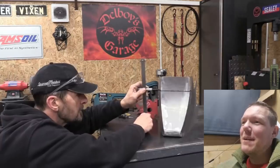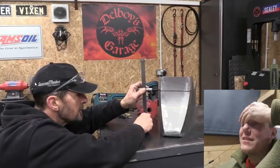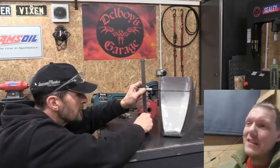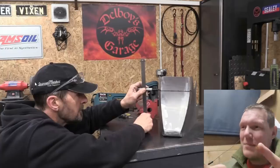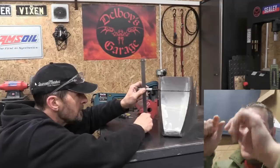You haven't even taped the pen to it. You're not using a square, right? If you want to do this, he hasn't got a surface. He hasn't got an engineering block. He hasn't got a height gauge. But if you want to do this, get yourself a big carpenter's square, and then tape it to your ruler in 2 points, top and bottom, so it stops it rotating. And then do it with your pen like that.